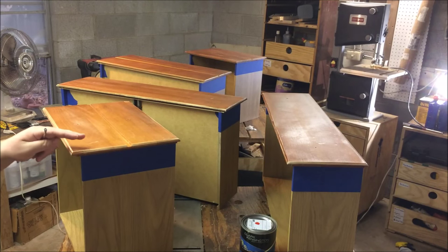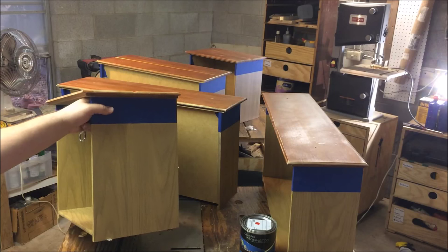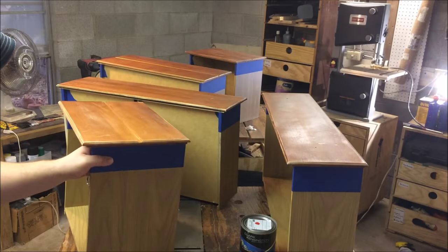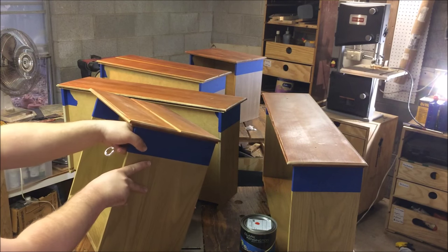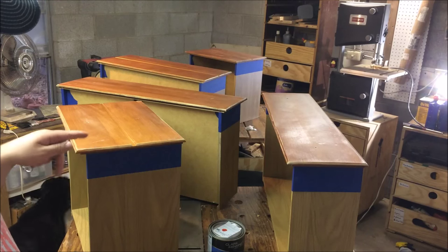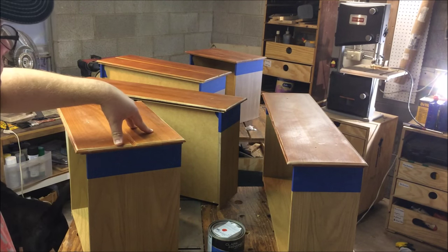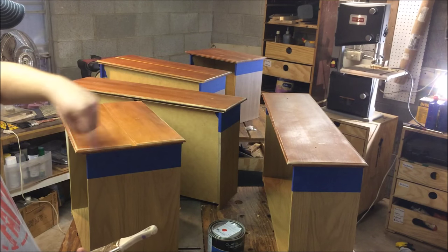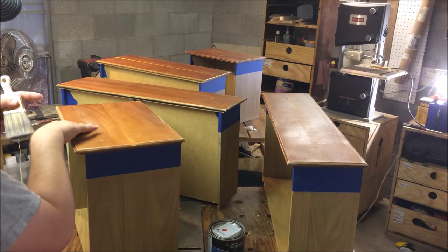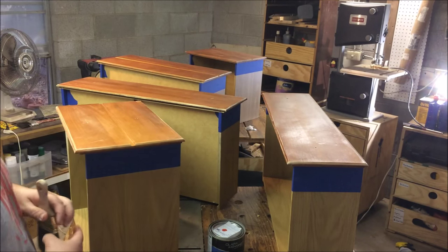You don't have to tape everything off, but it just gives everything a little bit more of a professional look so you don't have any smears, especially since I'm doing this for someone else — I really want it to look professional. I just sanded this and now we're going to pop this open, give it a good stir, and paint it. I'm not going to worry about getting absolute coverage because this is going to be my covered layer. I'm going to make sure to get the corners really good, around where the handles are, because that's where I'm going to sand through to reveal the red when I'm done.